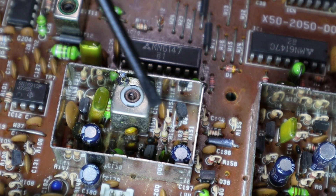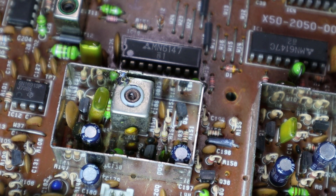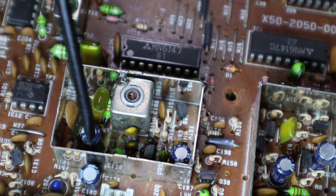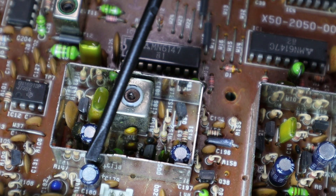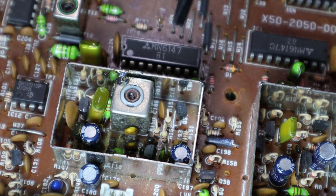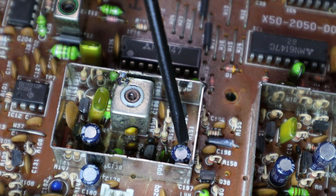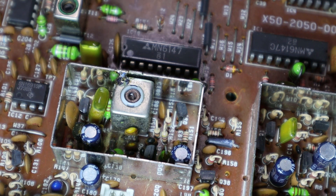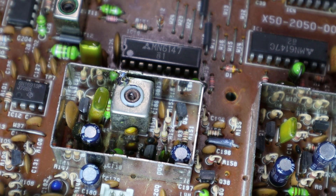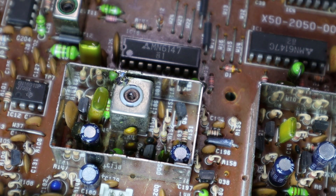You may be able to see that all of the goop that would normally have been in here from the factory has been scraped out — most of it anyway. There's some residue left on the bottom of the board but for the most part it's gone. If you're not familiar with this particular problem on the TS-440s, the goop that the factory puts in here becomes slightly conductive over time and causes problems with the VCO. It usually manifests by causing the display to read all dots, making the radio unable to be tuned or used. The fix is to scrape all that junk out and then the radio usually starts working again.